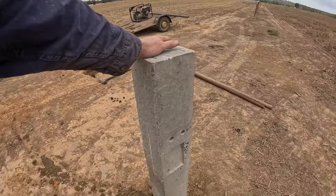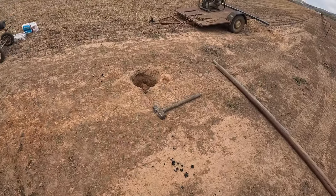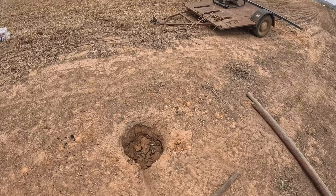How's the setup? Yeah, get through these post holes. Well, they probably got three to go, so just ran out of gravel. We just use wash gravel. Probably not ideal, but it seems to work. Yes, concrete them in and put a stay in there. We hit a steel post at the end and then concrete in that as well, so they don't seem to come out, which is pretty good. So yeah, the old man's going to get some more gravel and then I'll tip this one in.